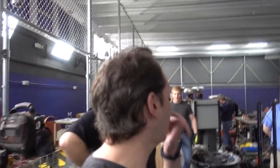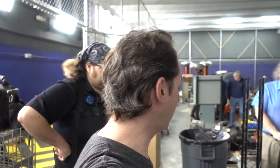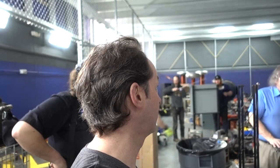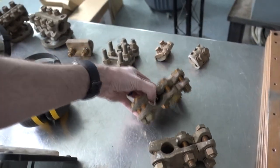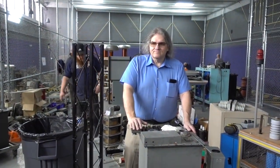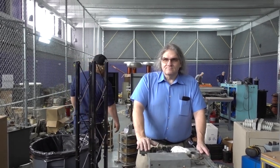My only real concern in all this is, because we're going with so much bigger cable, the inductance goes down. We start to grenade capacitors. That's the only thing I'm worried about. Everything else should be fine. We've got some substantial inline series resistance, ESR, effectively. But because we're reducing the resistance so much, I'm worried about angry bad things.